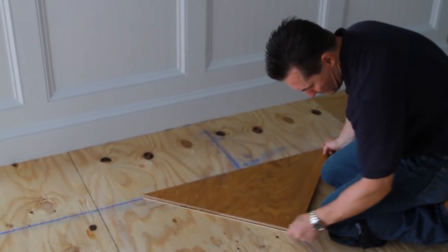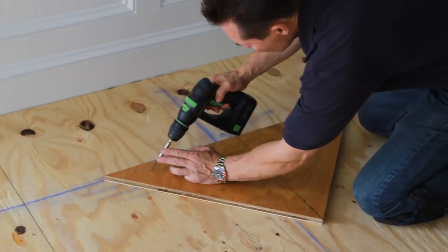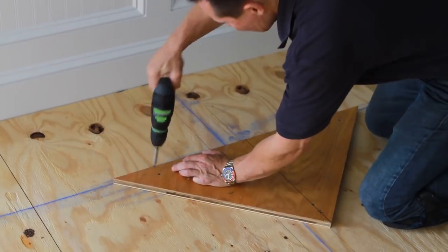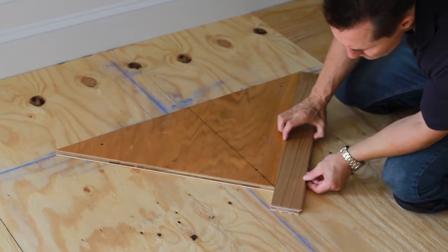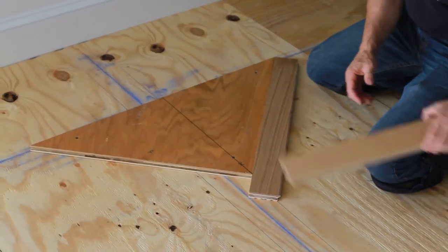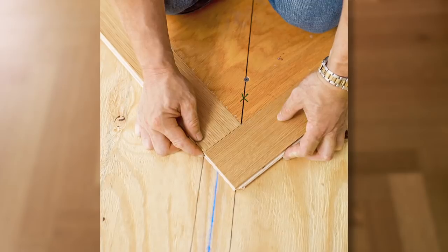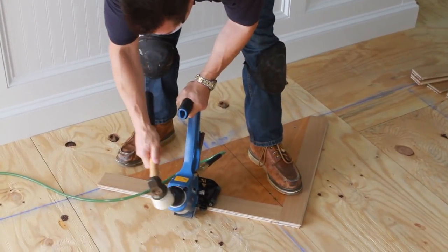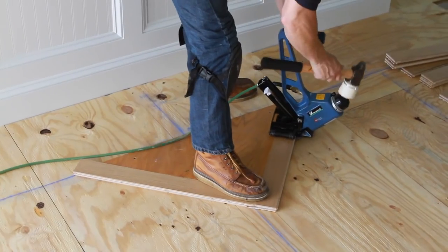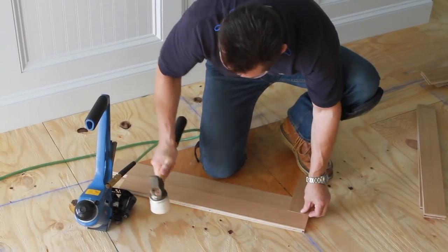To give yourself a place to start, cut a right triangle of plywood with the short sides equal to your slat length. Screw it into the subfloor with the 90-degree point right on one of the working lines. Then fit one slat against the blank, tongue side out, with each of its corners on a working line. Place the second slat overlapping the end of the first. Now you're ready to start nailing — place the flooring nailer against the boards and strike it with a mallet to drive nails through the tongues.